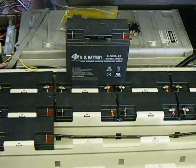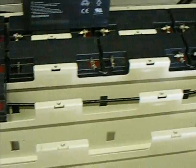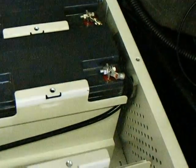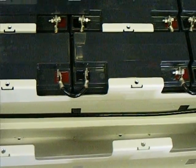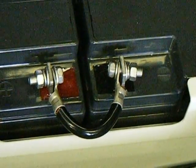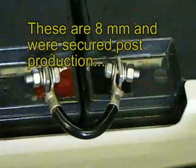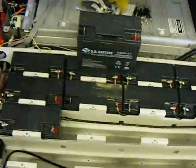This is the battery installation. There are 20 lead-acid batteries by BB Battery. Notice the connection from there to here runs behind the battery in this open area. Also notice that each and every battery connection has a washer and a lock washer — it's critical that the lock washers are present. Arcing can occur if these connections should become loose. We don't want to have a plasma event.